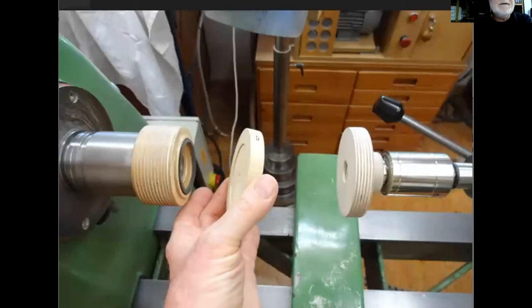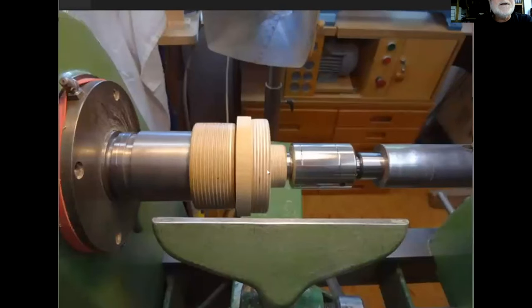So, and that's how I made the wooden part. In this case, I used my vacuum chuck. There's a wooden rim here, and then I put the seal inside here. And the wooden part just fits into the recess I drilled here. And then when I switch on the vacuum, the seal compresses and sucks this wood against this, and it registers really nicely. But you don't need to do that. You could also have a press fit where you just press it on there. And to get the diameter right, I have a second disc here on a chuck that I put on there that gives me the right outer diameter so that I can turn the outside, I can turn the step in there, round the edge over a little bit, and then it's nearly finished for putting the insert in.